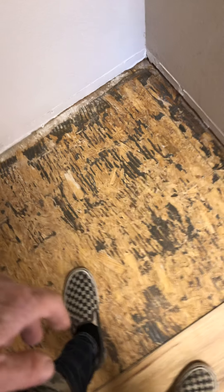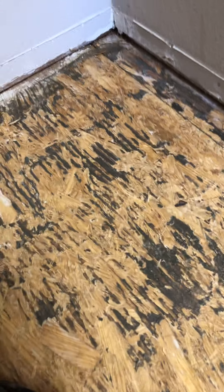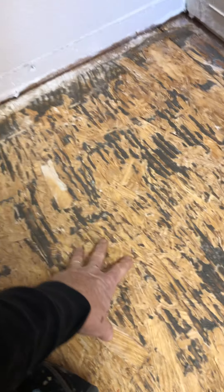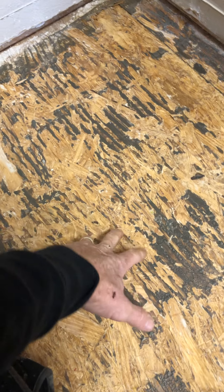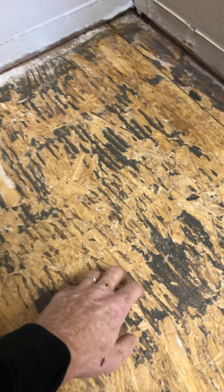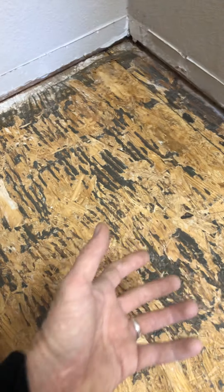Here's the OSB — this was the original decking in here and somebody came in and did a glue-down system on their substrate. This was never cladded. You don't ever want to glue anything down to your original decking on an elevated second or third floor, because this is not like concrete, and when you go to remove the old flooring it's going to be very bad.